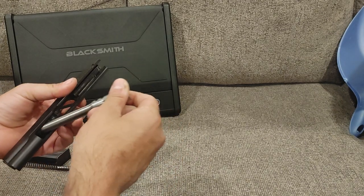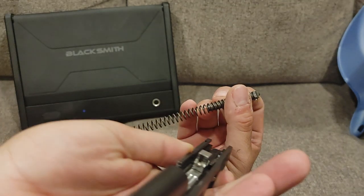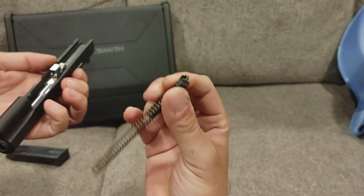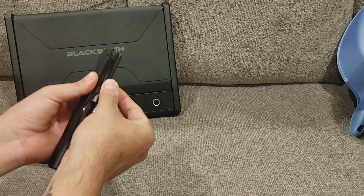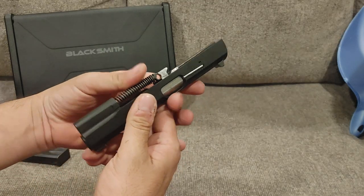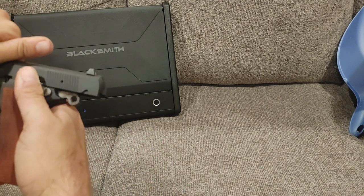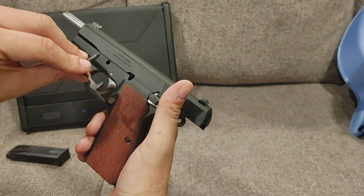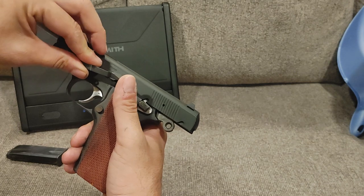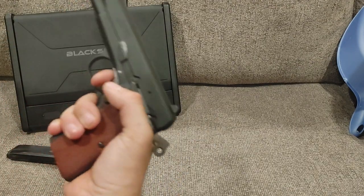We're not taking it further apart. This gun should, in theory, work fine and as long as it does I will not be screwing with it. Take a look at how you have the barrel, because you will also see that the notch in the bottom of the barrel is off-center, so you need to make sure that is off-center to match. Reassembly is exactly the opposite. Try not to launch the spring around your room. Insert it, and you will see you probably will have to adjust it a little bit as you reinstall the slide onto the frame. Bring it all the way back, lock it back using the safety. Take your slide lock/slide release — this is actually going through that piece of the guide rod, so it holds the guide rod in place. Wiggle it in, and as you can see it goes in nice and loose. Bring it down and make sure the gun works.